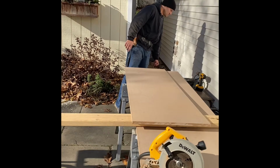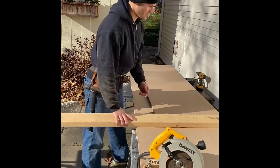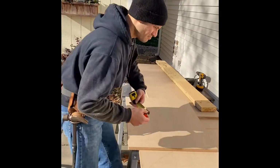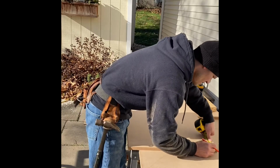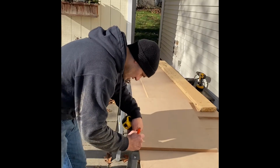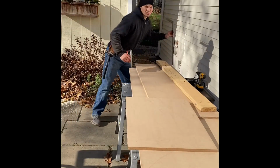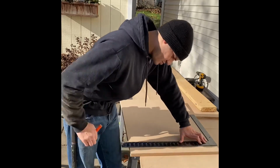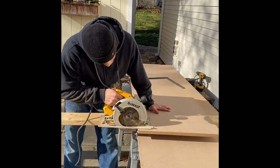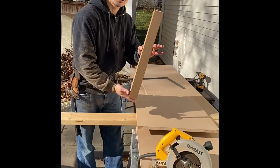Alright, my sides are going to be 2 1/4 pieces. So that's your face. Put that over there for a minute. I'll have to make some pieces 2 1/4 to the side. Let's see, it's a nice straight edge on that one. Mark 2 1/4, top and bottom. The old square, the old pencil mark, flat out. Like a surgeon with a circular saw.